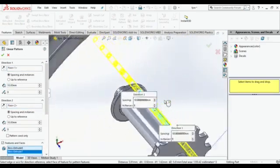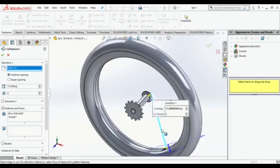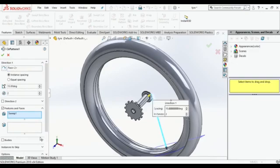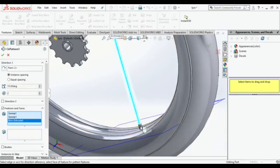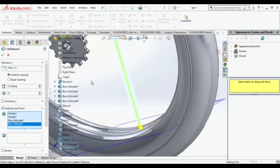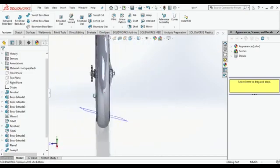Now we are going to make the circular pattern. Circular pattern over there of that rod, that polish rod, and just wait for it. Select all those parts which we are going to pattern circularly. Make 15 pattern, 15. Let's see. Select over here. You can select over here also in the type defaults, and you will get sweep boss, extrude 7 and extrude 8. Select those three parts and 40 patterns, and hence you will get that pattern of it.